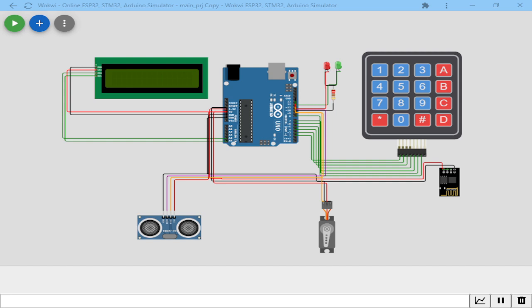So this is just a sample of a typical vending machine, but what I've added to it is this sensor here, which is an ultrasonic proximity sensor. There are many details about it; you can search it online. There are various types of proximity sensors: infrared, ultrasonic, resistive, inductive, capacitive. I don't want to go into details, but I decided to use ultrasonic because it's cheap, readily available, and easy to integrate with the controller that I'm using.